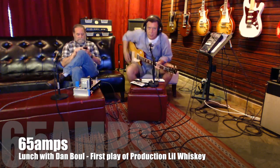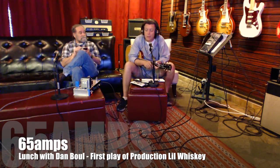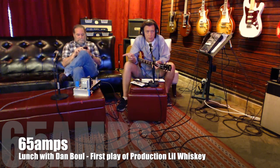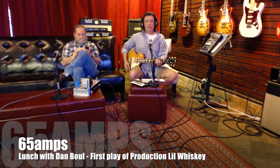Bill Studio asks, what's the difference between the Whiskey, Little Whiskey, and the Big Whiskey? The Big Whiskey is 50 watts. It runs on 6L6s. This is 18 to 20 watts that runs on EL84s. Big sound in a little box.